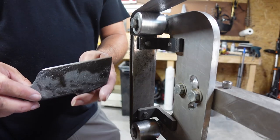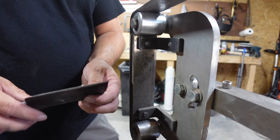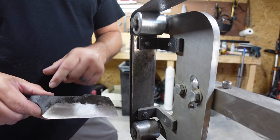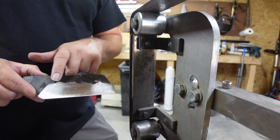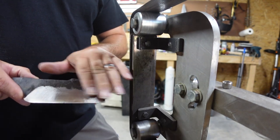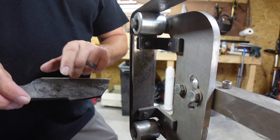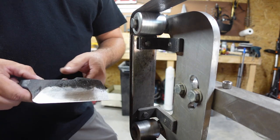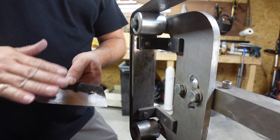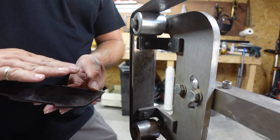So when it comes to grinding bevels on a knife that has that forged texture, there's a chance that you could end up with different lines here. So one side could be really flat, one side could have a slight bow in it, so it's going to make this come up higher faster than this. This could have not been perfectly flat, but had a slight concave to it.